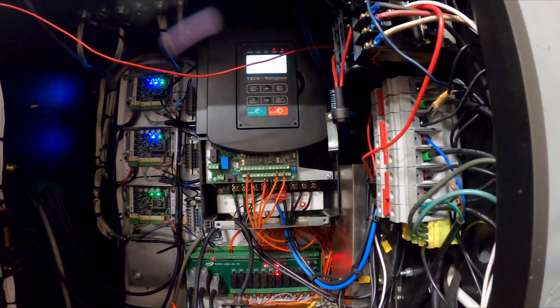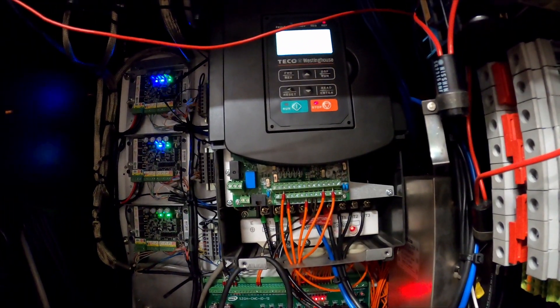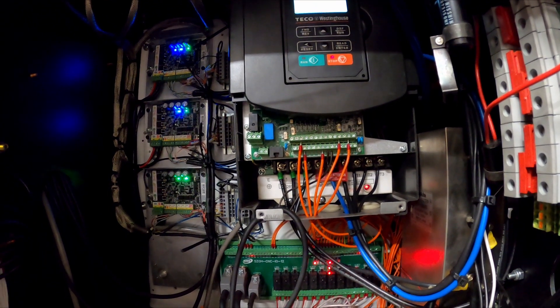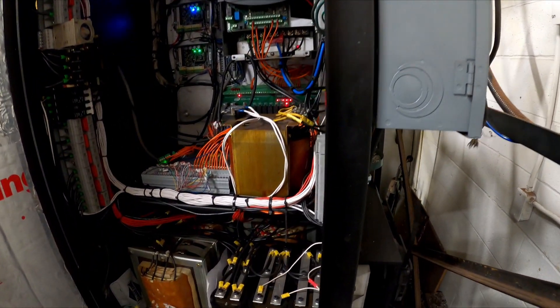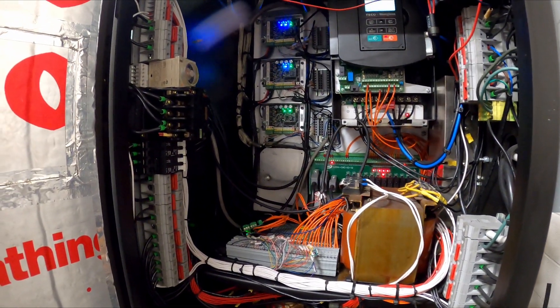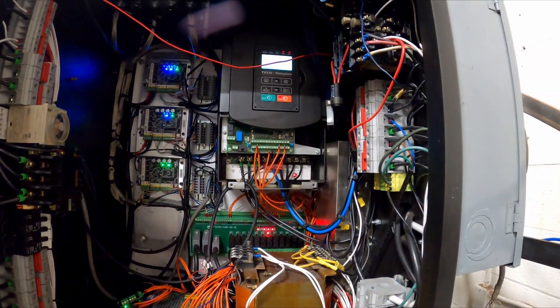The spindle drive is just a regular VFD — it runs 0 to 10 volt, which is absolutely perfect. This control will also take an encoder, which I haven't wired up yet. It's still got the original one, which is 12 volts, so I've got to remove the original and put a 5 volt one in. But apart from that, the machine just works great.